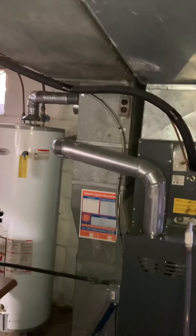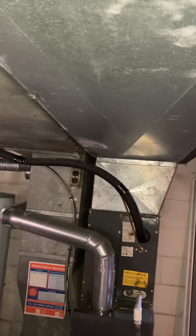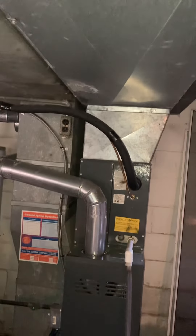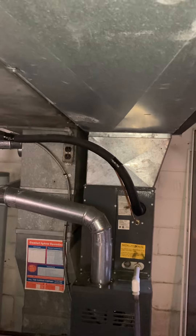In my opinion, we just take everything out and put everything back together. We've got good height — we can get the furnace on a base. These trunks are about 18 inches wide, so if we come back with a B-width furnace, we should have everything in a nice line. There's even an offset on that supply plenum at the moment.